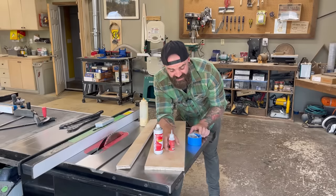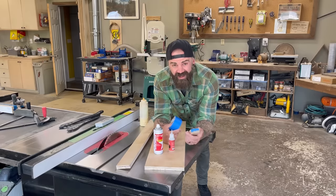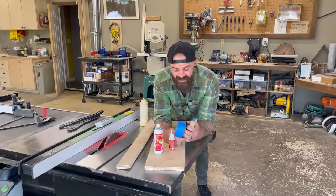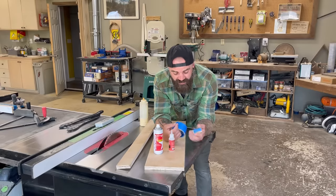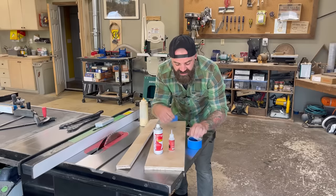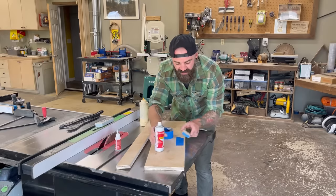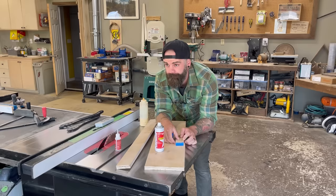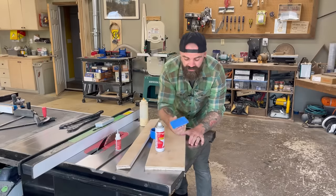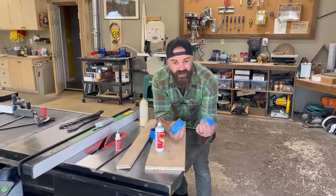The number one way I use CA glue is to make jigs or attach things. Sometimes you use it for templating out things on the router. Normally you'd use double-sided tape to stick the template on top of your stock piece and run it through the router — but what if you don't have double-sided tape? You can use CA glue and regular blue painter's tape. Put a piece of tape on your template, take another piece of blue tape and stick it where you want to glue it, add some CA glue on one side, accelerator spray on the other, and press and hold. It's locked on there — nice and secure. And when you want to get it off, you just pull, and because you taped it on there, it pops right up clean.